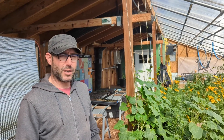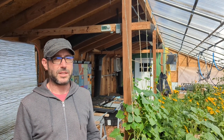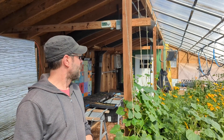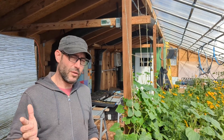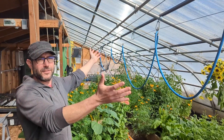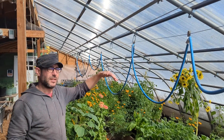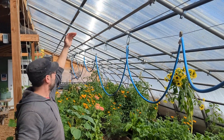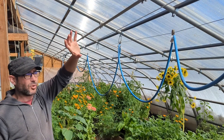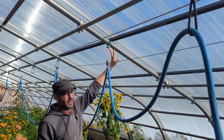I just wanted to go over a couple things about this particular design, if you're thinking about building one of these farm scale winter greenhouses using the U of M design document set. So we've got a pretty massive glazing wall here — this is essentially half of a hoop house. This is your standard gothic style trusses and then purlins that go across, all supporting this eight millimeter double wall polycarbonate.